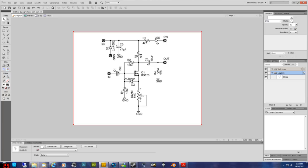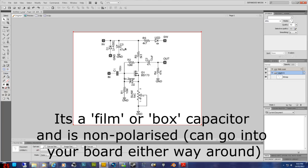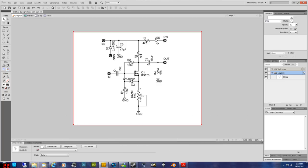You can see that it's two bold, straight lines, whereas the one we looked at before up here has got the plus and the curved line. This particular capacitor is actually the input capacitor. It's called the input capacitor on guitar pedals, and it's pretty common to see a 100 nanofarad capacitor next to the in. If you increase the amount of capacitance on the input capacitor, you actually allow more bass to come through